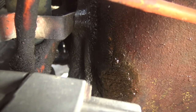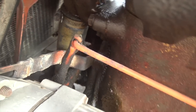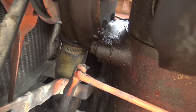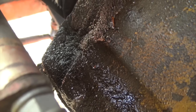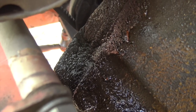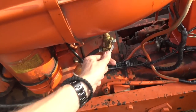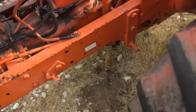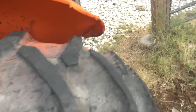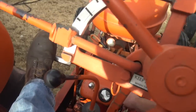The other thing — you can see all this wet oil that's everywhere in here. This is leaking from probably multiple places, so we're going to try to clean this mess up and change out some gaskets. Since there's all that caked-on wet-looking oil up towards the bottom front of the engine, I think it might have lost its front main seal, so I picked up a new one of those. I haven't driven this thing around in probably two or three weeks, so let's see if it will start.